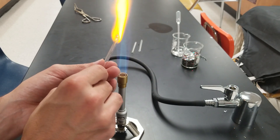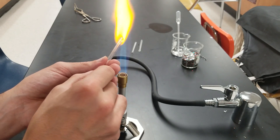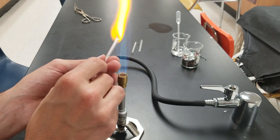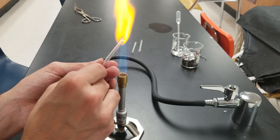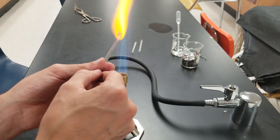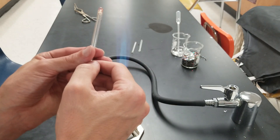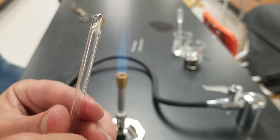As this continues, I can see the tube is definitely closing up. I'm pausing just a moment because it bent in one direction, so I was letting it bend back in the other direction. At this point it looks like it's pretty well closed. Here in person I can definitely see the tube through the flame, and I can see that it's pretty well closed up. I see it bent a little bit, so I'll keep it in the flame and let gravity pull it down in the direction opposite of what it bent — this isn't strictly necessary, I'm just doing this for cosmetic purposes. The empty space there no longer goes all the way to the end — it pinches out, and I have a solidly melted closed tube.